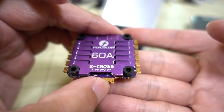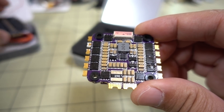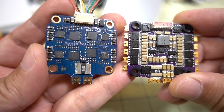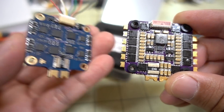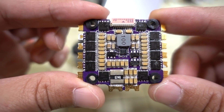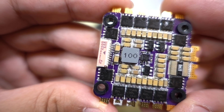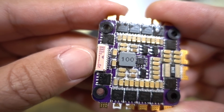The conformal coating is usually on the bottom of your frame, so if there's any water splashing or moisture it'll help a little bit. The iFlight doesn't have that — you could always put conformal coating on yourself, it's not that hard. This Flycolor comes with a ton of filtering capacitors. I think that's the switching voltage regulator — 5 volts, 3 amps. There's a current sensor and the micro connector has labeling: ground, ground, VBAT, 5 volts, motor outputs 4, 3, 2, 1, current sensor, and ESC telemetry. And it looks like the heat sink is glued on with that white thermal compound, so I'm not going to be popping that off.